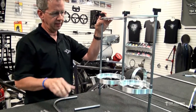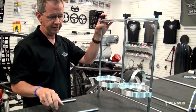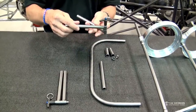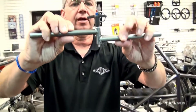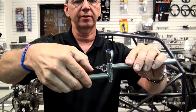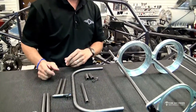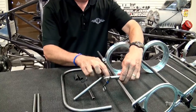We're going to let you do this final welding because at this point we can still ship it in a small box, whereas before it had to go in a very large box just to get the rack in. So you're going to get the rear hoop, this brace, and also two sets of these little T-mounts. One welds to the side of this rack, and one welds to the chassis — they go together just like this. The top portion will be on the rack, and you'll pull the pin and the whole rack will slide out. You're also going to get a small piece of tubing, and if these stick out very far we'll gusset that with a small piece of tube.